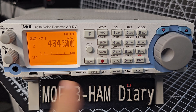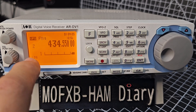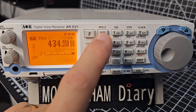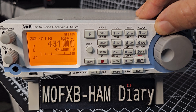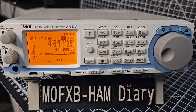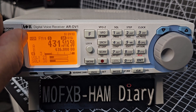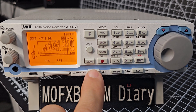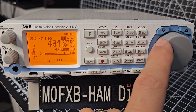Notice that when it saves and you press enter to hold the frequency, it takes you to Z. So to come out of Z, just press AB again — you're back to AB. If you want to start searching, hold up or down and it starts to search. Another thing: if a frequency is really annoying and you don't want to keep stopping on it, you can press pass, and then it will skip it next time round.